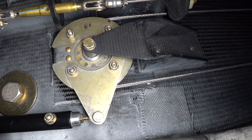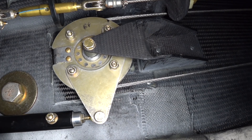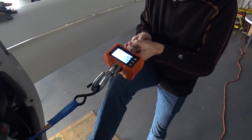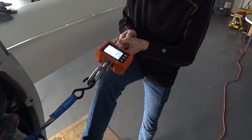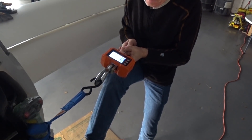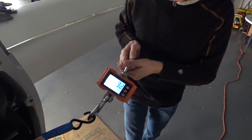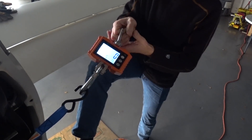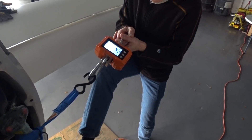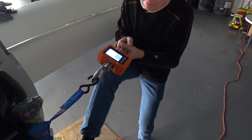Out in the wing there, you can see there's just a tiny bit of movement. It is translating to the bell crank linkage onto the aileron, but it's just so minuscule now — completely okay, at least in my opinion. This is showing you how much stick force it takes. I've ended up putting about 75 pounds on here before I get it all the way to the stop. I can still dial in a little bit more pre-tension. I think it's 75 or 77 pounds before I get it to the stop, and I think that's acceptable.